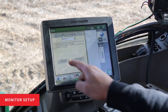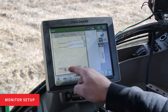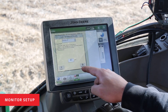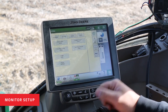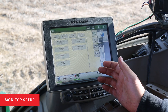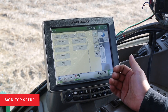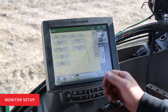Go ahead and calibrate the second pressure sensor. Be sure to select sensor 2 from the drop-down list and do a voltage-based calibration of 20 millivolts per psi. Now both pressure sensors have been calibrated. When you calibrate your pressure sensors, be sure that your 360 Equiflow system has been fully bled of any anhydrous ammonia vapors. Even the smallest presence of anhydrous ammonia in the system can read some pressure and give you inaccurate pressure readings.